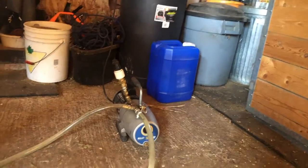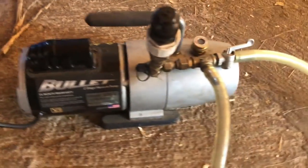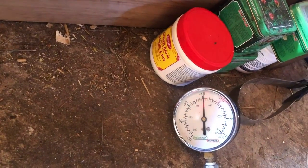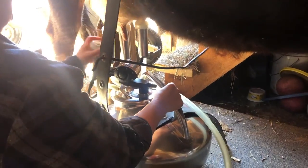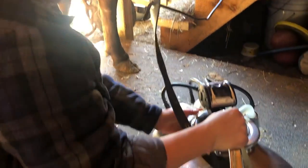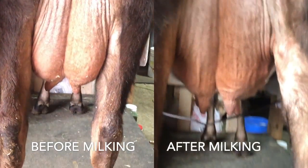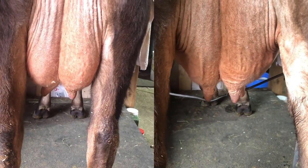Let's pop over here and show you what the pump is. This is a two-stage vacuum pump. There on the top where that black and white section is, is a dial that will increase or decrease our pressure. This little gauge here shows us where our pressure needs to be, and you can see it jumping with the pulses of the pulsator. Now she's done. So what I do is pull it off and then you actually have to release the pressure — you see me hold that one inflation up and that releases the pressure of the whole thing. I'm able to take it off without hurting her at that point.